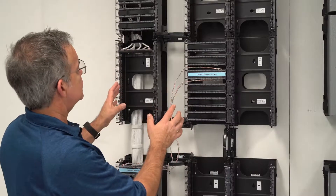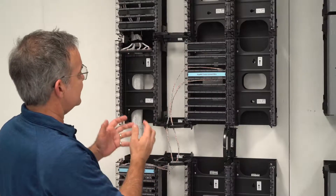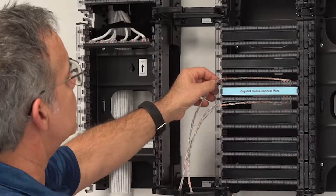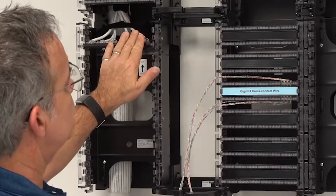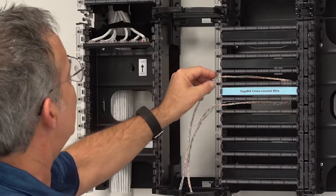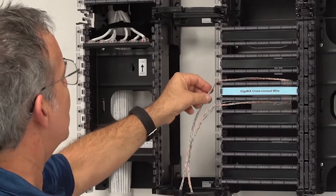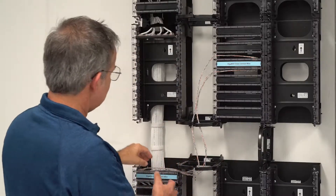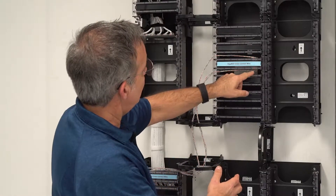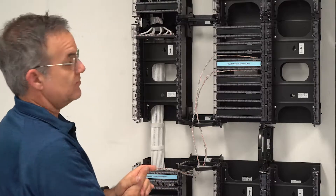As I mentioned before, this system is managed with jumper wires or cross-connect wires as jumpers. These are Category 6, four-pair cross-connect wires — they terminate just like cables. The cross-connect wire on this connector runs up through the fanning strips. The same strip that is holding the connectors — your cross-connect wire runs through it and then runs to, let's say, the equipment section of your cross-connect. The one at the bottom will run through the fanning strip again to the other section of your cross-connect.